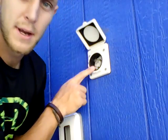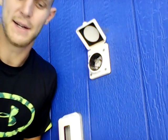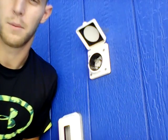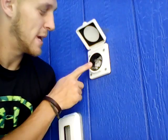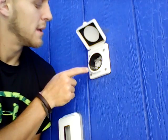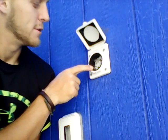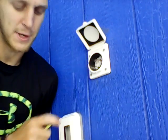First I'm going to start off with the input. This is a 50-amp 220-volt input. In case in the future I did want some large electrical items like a range and oven or a big old dryer, I have the potential to do that. You can see here I've got three prongs and a little metal strip — this is the ground strip. There's a neutral, a 110-volt hot, and another 110-volt hot.